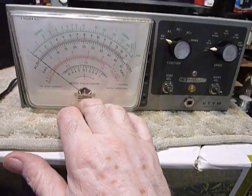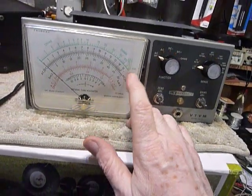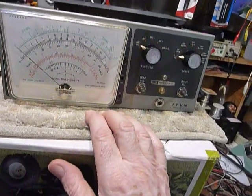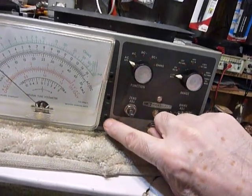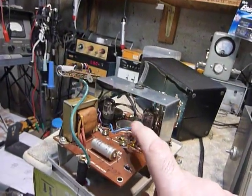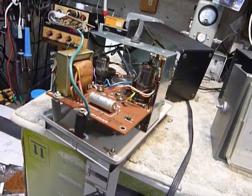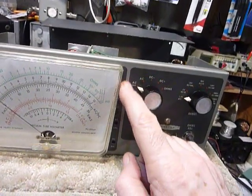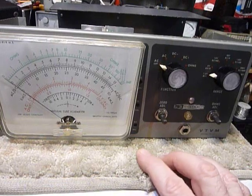It's very handy and measures AC volts, DC volts, and resistance. You can match 1-ohm or 2-ohm resistors if needed. I especially like the bench model because it has calibration access holes right here — you can stick a screwdriver in and recalibrate it without taking it apart. On the other models, you have to disassemble them to reach the calibration controls on the circuit board. The case here only has two screws, so it's nice to have calibration right out front where you can get at it.